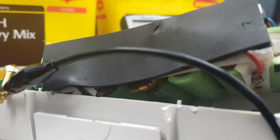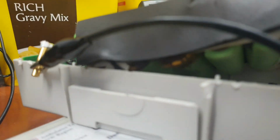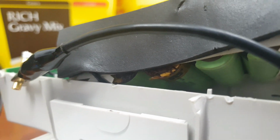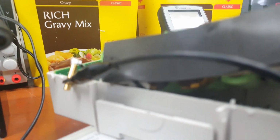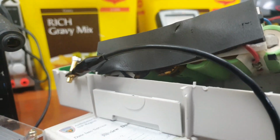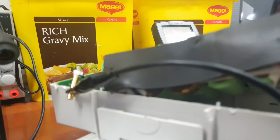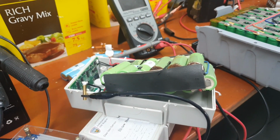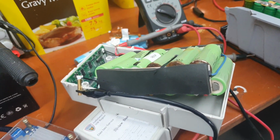So I sourced it up to 1 amp, and then while I was sitting here, we're only up to 9 volts. But yeah, I sourced it up to 1 amp, and look what I find. The cell's actually rusted through the base, or corroded and rusted at the same time. So I may have to open these anyway. Let's turn the power off to him because he's actually venting electrolyte smell. So I may have to open these and look for water damaged cells, water moisture leaked cells.